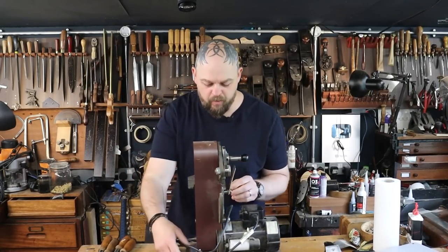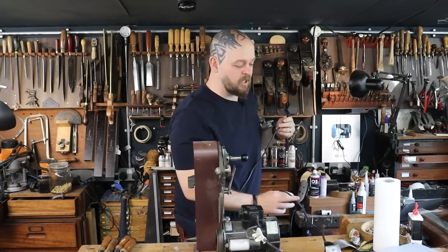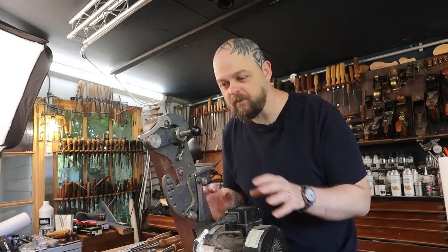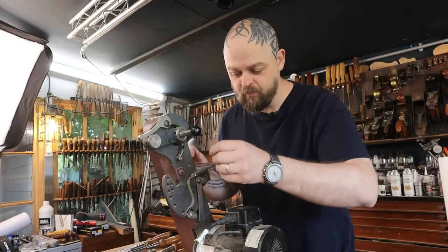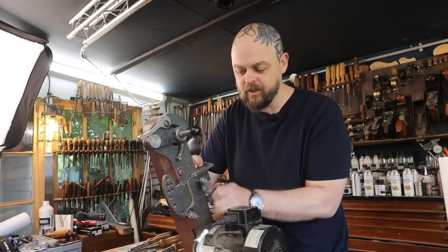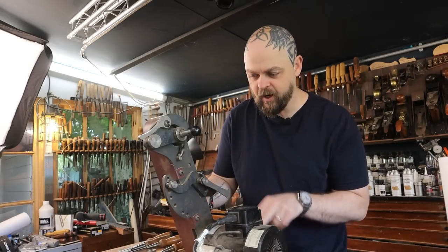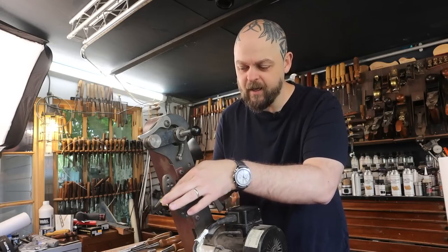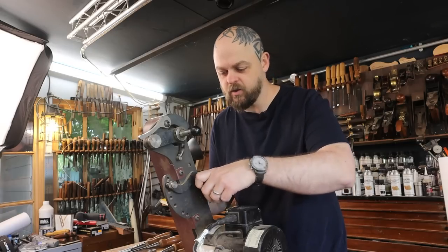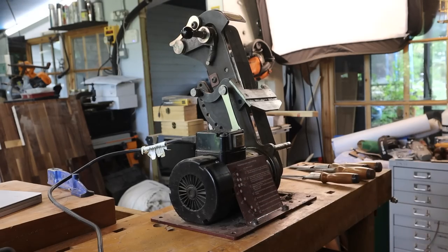The Robert Sorby Pro Edge is my favorite machine for grinding and sharpening tools — bar none. This isn't sponsored, it's just what I use. I've currently got the table set at 90 degrees, but I want it at 25. All of these holes here have got a set angle — that locks in there, that locks off, and that is 25. I've got a cheat sheet on the front telling me what angle is what.